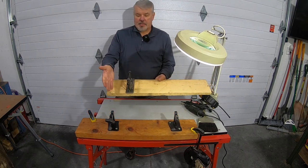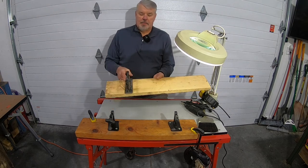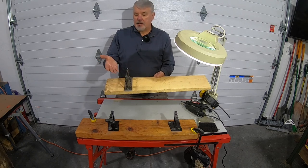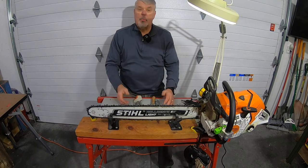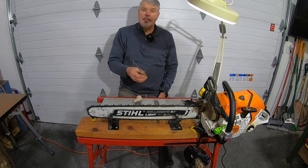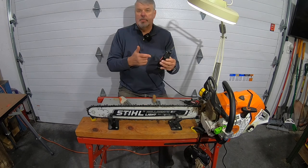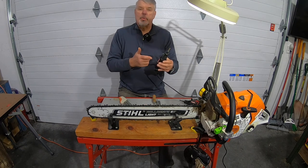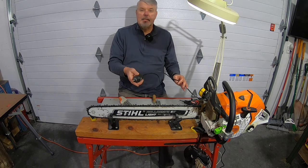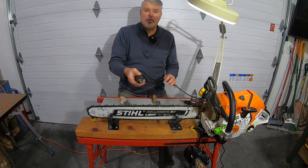his brother, made this one here. Very simple. This is probably around $75 for the pair. This right here, if you have a piece of metal and you know somebody that can weld a C-clamp on it, you could probably get it for under $10. Now once you have the saw mounted on the stand, you have multiple options. You can either do a filing by hand, you can use the two-in-one, or my favorite tool — the rotary or Dremel tool with an abrasive stone on it. Goes very quickly. The nice thing about this sharpening station is I can work on it from either side, from left or right.